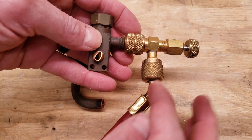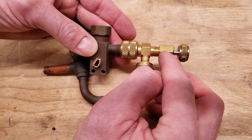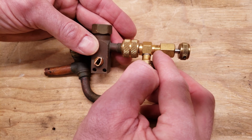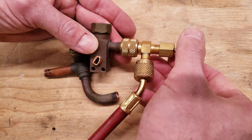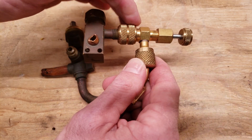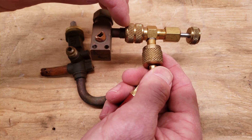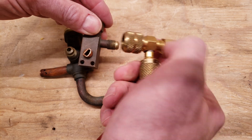Connect on and this is what presses in on the valve core — you can do this at your own pace, no rushing. It's going to press in on the valve core and allow the refrigerant through. There are several versions of this type of fitting. This one has what's like a packing nut that can be tightened if there happens to be any refrigerant leaking out. I like this version because it also has a backseat — make sure you get the right version. To disconnect, you turn this all the way counterclockwise to the backseat position and snug it up, which locks the refrigerant in the hose and reseats the valve core at the port. With gloves and safety glasses, you can just take your time and disconnect.